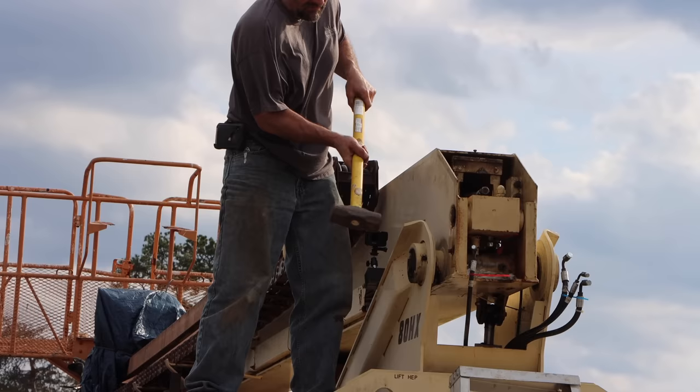The chain attach block. This is where the extend chain and the retract chain meet. The chain has looked pretty good throughout, but I'm not sorry I tore this apart. The cylinder needed to be rebuilt, and not knowing the state of this chain when you're 80 feet up isn't fun. And these pins, so we'll get a look at all this. Save those cotter pins, you can reuse those things. I'm just kidding, I'm not going to reuse those.